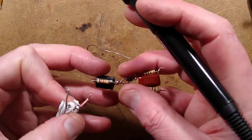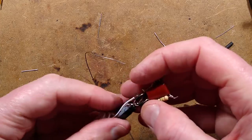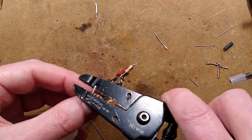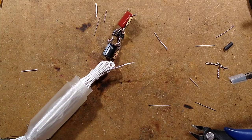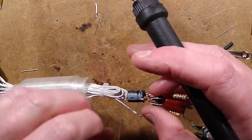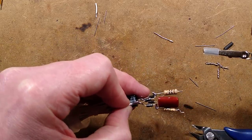I shall flow this onto the positive which is coming via the resistor. This will connect the LEDs to the capacitor via that current limiting resistor, which is designed to limit peak current, transients, and incidents. This has been quite a time-consuming project, partly because of the 3D printing issues. It's a therapeutic thing - it's not something you're doing to manufacture stuff for friends. And if friends see it and go 'oh wow that's amazing', say yes, they can build it themselves and promptly don't volunteer to build it for them.